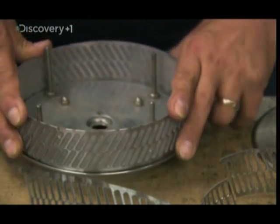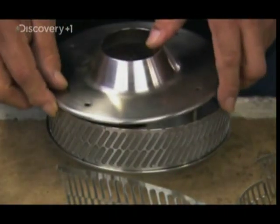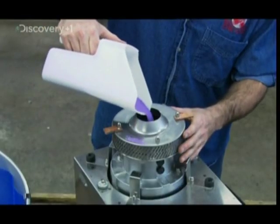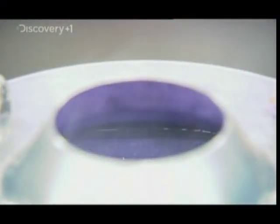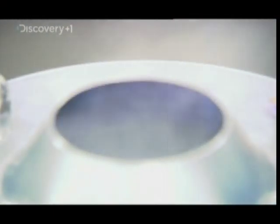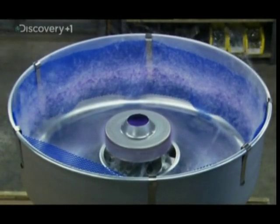An assembler fits the band inside a spinning container called the head, where the flavoured sugar will go. These are the mechanics behind candy floss: heating elements in the head melt the sugar, then centrifugal force hurls the liquid sugar out through tiny holes into a large, wide bowl. As the threads hit the air, they solidify, creating a spider's web of sweetness.